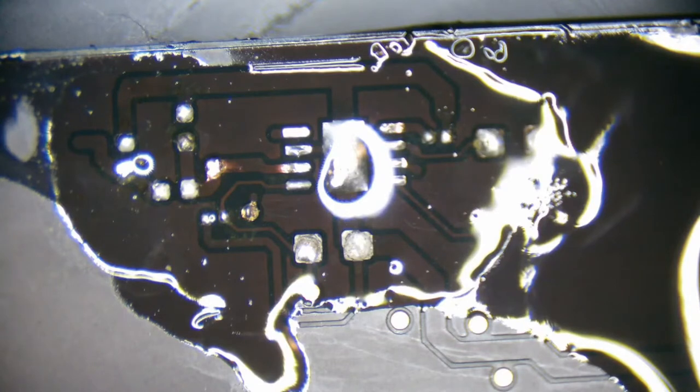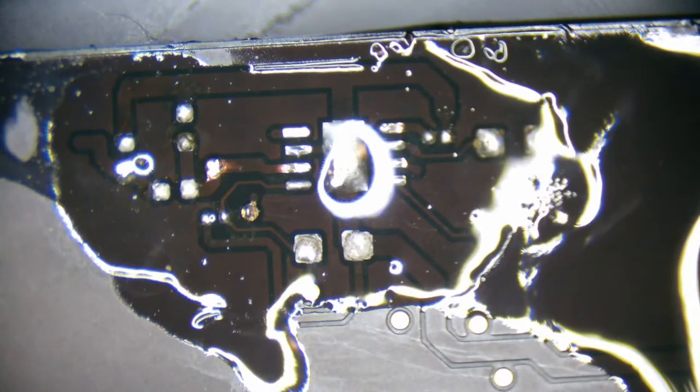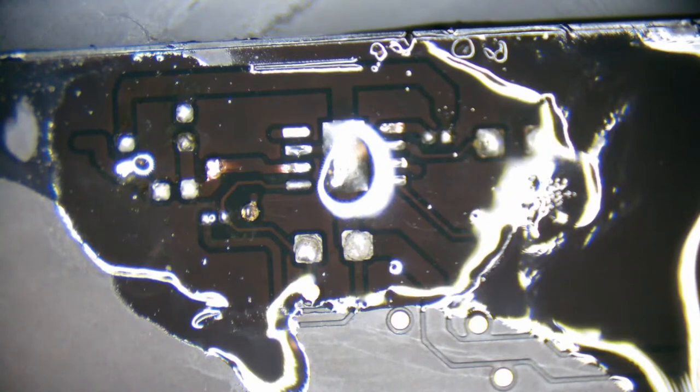Here we are, found one that's in pretty good condition. Had a little corrosion by the PMIC, I'm sorry, I hate that for you. Had a little corrosion by the PMIC, but was working. I replaced the cap and PMIC, test is still good, ultrasonic clean, and now 20 volts, 10 milliamps. Aww.